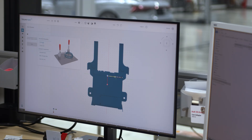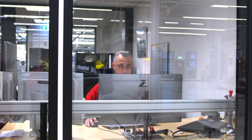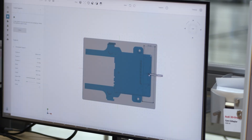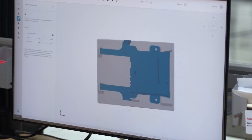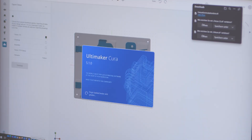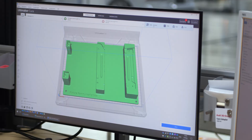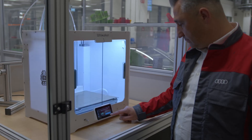The workflow in FixtureMate is very easy. You put the part in, make the base plate, choose the supports needed to hold the part, and subtract the piece from the fixture itself. After that, you make the name tags, and if you want, you can add clamps to the fixture as well. Then you export it, bring it into Cura, set the parameters — layer thickness, infill — and print it directly. The whole process takes maybe 20 or 30 minutes.